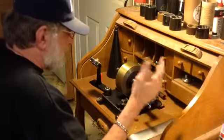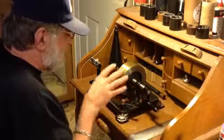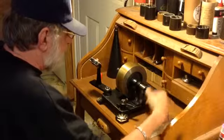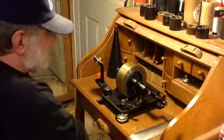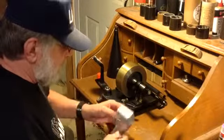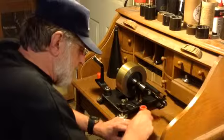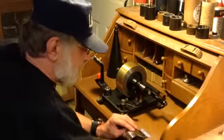It's really time consuming to get this machine adjusted. What I'm trying to do is make final adjustments on the machine so it'll stay adjusted. It doesn't have to make super loud recordings as long as it makes good consistent recordings — that's what I'm looking for. Since I changed the diaphragm, the machine has been making fairly decent recordings.